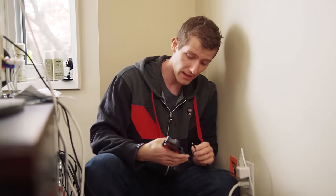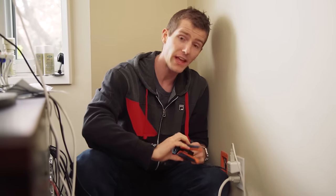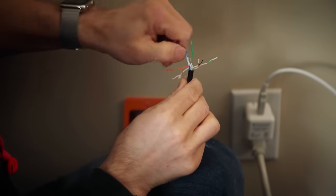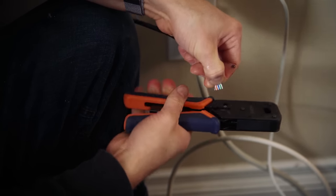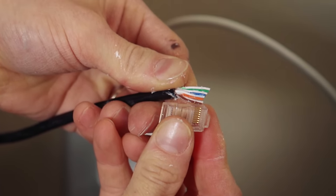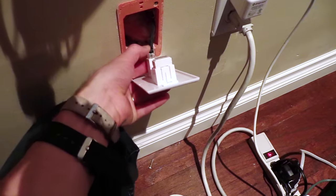Here's a brief guide to terminating your ethernet cable: strip the outer sheathing — and since this is outdoor cable there'll be some gel in there, don't worry about it. Separate all your twisted pairs, align them in the correct order according to your wiring diagram, place them into the cutting tool on the crimper with the outer sheathing sticking into the connector the right amount, then feed the ends in without stripping them, insert the whole thing into the slotted part of the crimping tool, crimp, and remove. It shouldn't take longer than a minute or so per end once you get the hang of it.